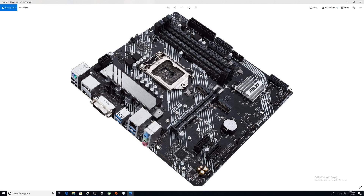The CPU goes in the LGA 1200 socket here. Don't even think about putting a 7th, 8th, or 9th gen Intel on here — this only takes 10th gen, and it should eventually take 11th gen with a BIOS update. It'll probably be the same process we went through with 9th gen. This will come with a black cover over the socket. It supports up to an i9-10900K, though I wouldn't pair that CPU with this motherboard.